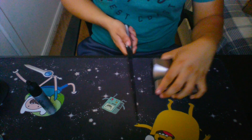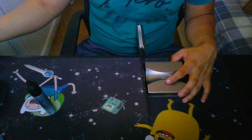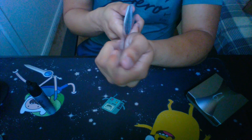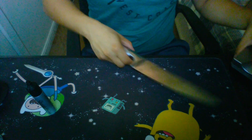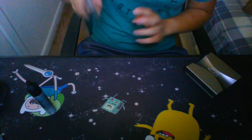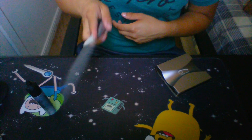You gotta realize that when you put fewer degrees, it takes longer to sharpen. If you put on 15 degrees, it's gonna take longer than 25 degrees, because at 15 degrees it's more like closer to standing straight up, so it takes longer to shave the metal off. Also, fewer degrees equals sharper. At 25 degrees it's more for splitting — like hacking at bone. 15 degrees is for slicing super sharp. That's when Ray does all his tricks, like standing paper up and cutting a hole out of it, or splitting one hair. I'll try to do that for you guys because this one I will sharpen to 15.